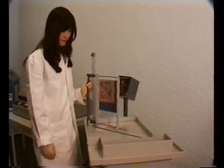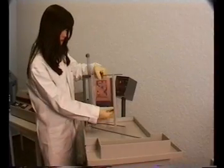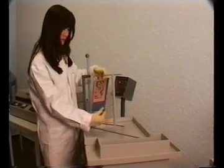Years of experience in large-scale production have shown that only vertical spray processing ensures the highest line resolution with a minimum of undercut. All Bungart etching machines achieve a line resolution better than 100 micrometers.